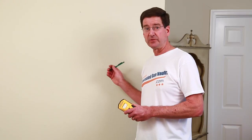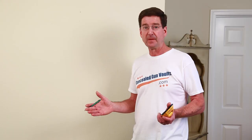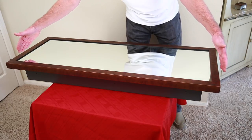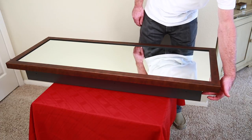Begin by marking the cut lines. Using the stud finder, mark the inside edge of the two studs that the vault will fit between. The standard distance between two studs is 14.5 inches, so your vault will fit perfectly between them. There's no reason to mark a vertical line since my saw will simply follow the stud as a guide. Now I'm going to sweep the space vertically between the two studs to confirm there are no horizontal blocks. The height of the unit is based on personal preference. The overall height of the mirror with frame is 49 inches, but the cutout for the box should be 43.5 inches.